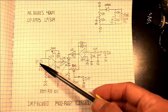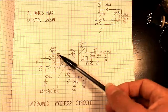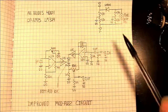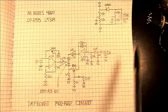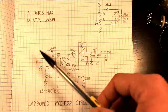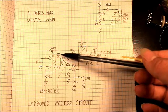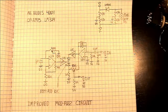If you notice, it's back at 1 microfarad, and I was able to do this by putting the tail end of the frequency control pot to oscillator ground. The reason why there's oscillator ground and signal ground right here in the power supply section, you can see they're separate. 99% of cases you don't want to do that, but in this case it helped reduce noise and the oscillator was more stable as well. It didn't quiver. And of course this has the advantage of having a smaller capacitor, and if this is turned all the way towards the ground pin, the oscillator will halt completely, so any remaining clicks, it's very faint, will just go away.